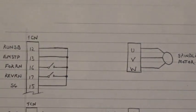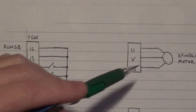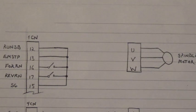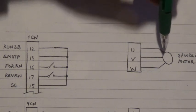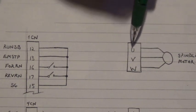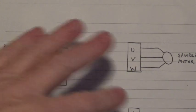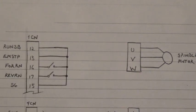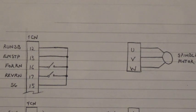Now these are lug bolts — a good size, not too big. I drew them out like this just for simplicity's sake. I don't have that spindle motor with resolver feedback, so I connected a bank of light bulbs configured in delta configuration. We have 6 light bulbs between U and V, 6 light bulbs between U and W, and 6 light bulbs between V and W to make delta configuration. I'll draw a little picture of those light bulbs and put it up at the end of the video along with this diagram. There are the control inputs and the motor.